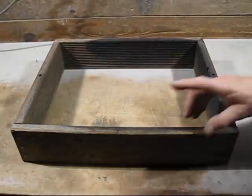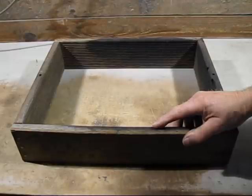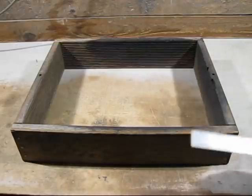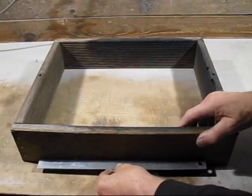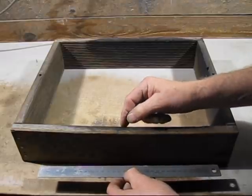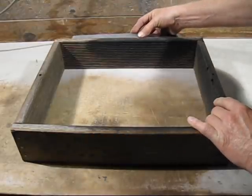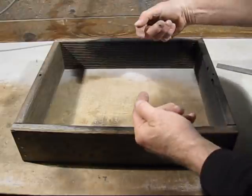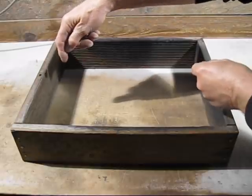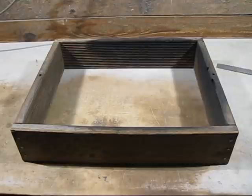So we'll have a look at the wooden moulding box and see what happened to it when molten cast iron is poured into the mould. Well, as you can see, it's pretty charred around here, here, and here. But the odd thing that I found strange was it's perfectly flat here, but because the edge of the surface plate is only 23 millimetres away from there, see what's happened? It's really distorted the piece of wood there, and the same the other side. So as it's pulled outwards like that, your two dowel holes here have pushed in a little bit, so the box won't shut properly. But I'll show you how easy it is to fix that problem.